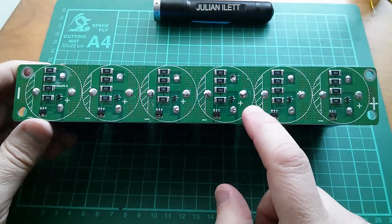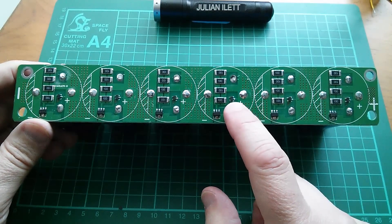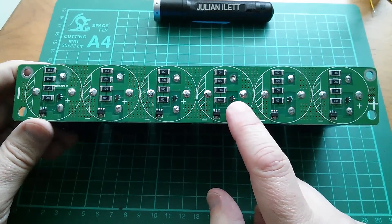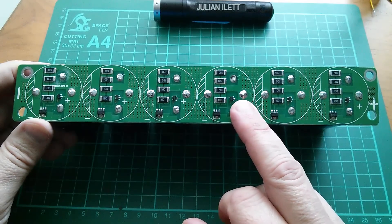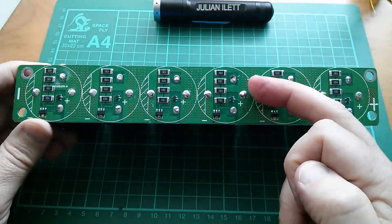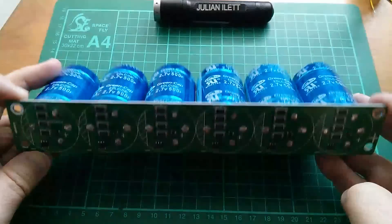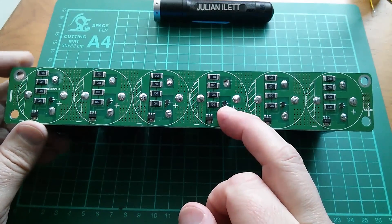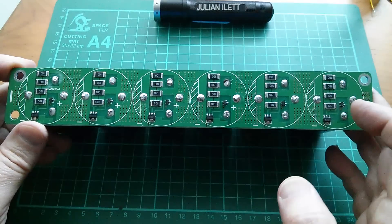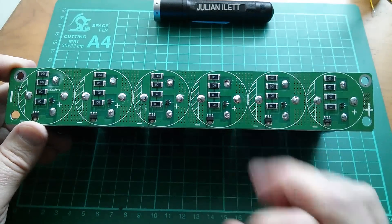When the capacitor voltage goes over 2.7 volts - it might be slightly higher because these sensor chips have hysteresis - they were originally designed to cut something off when the voltage dips below a certain level, so they tend to be set slightly above their nominated voltage. There are four 1.0.0, so they're probably 10 ohm resistors in parallel - that's 2.5 ohms - which is shoved across the capacitor when it goes over voltage.